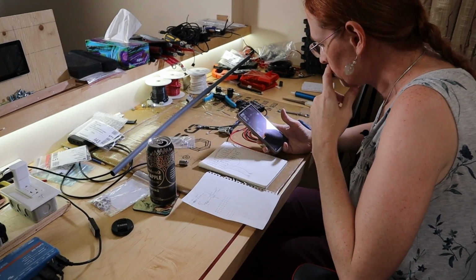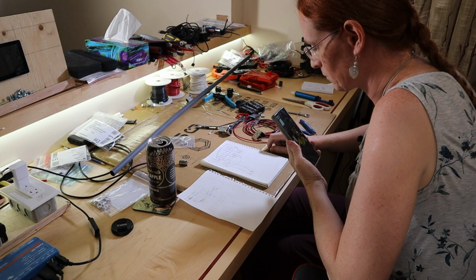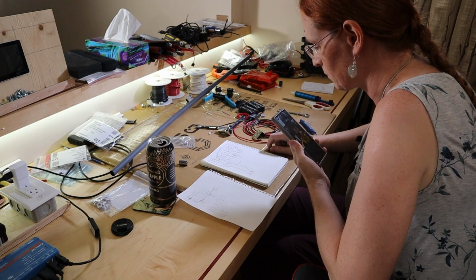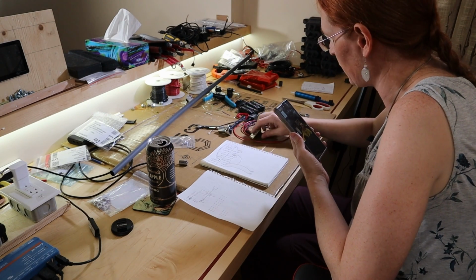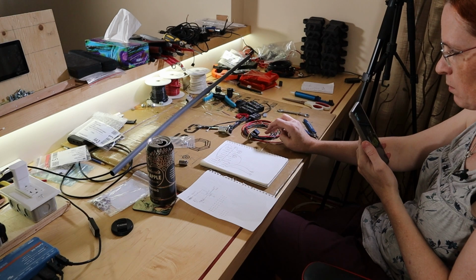Let's diagnose this. Think about what happened in your situation where you've got the capacitor before the diode. The capacitor in this case is not protected against reverse voltage at all. So if there was a negative spike on the line when you hooked up the load, there may have been a bump where it went down. If the capacitor saw reverse voltage for any amount of time, you're basically game over. And that would explain why this blew up. So let's say there's a dead short on the other side, or it drags the BMS down so far that it decides to do an overcurrent trip.